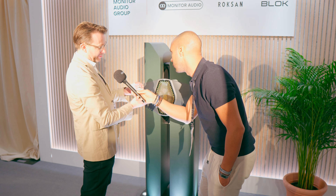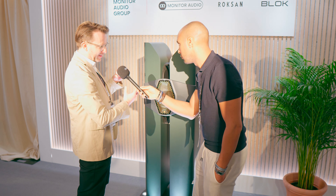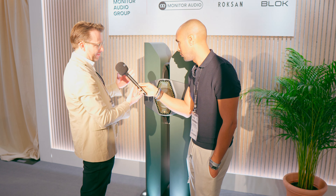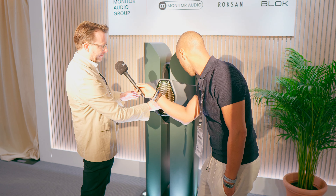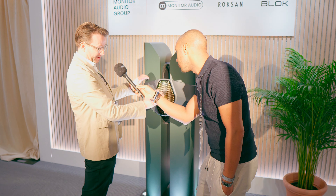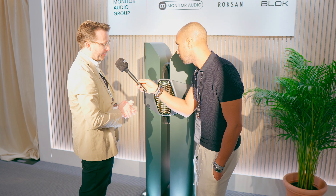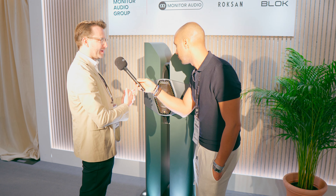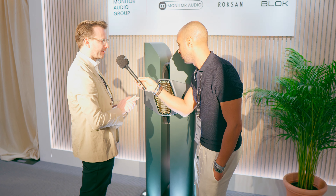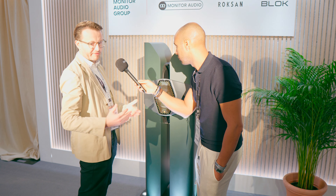These are actually developed to be more than just mid-range drivers — these are all full-range drivers. We did that in order that we don't stress the driver. The idea is that we can have a really great tweeter surrounded in a sort of dual concentric kind of array without the issues of having a larger mid-range driver moving around the tweeter. So it gave us a lot of benefits acoustically.